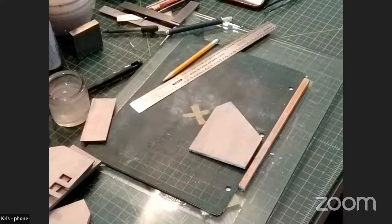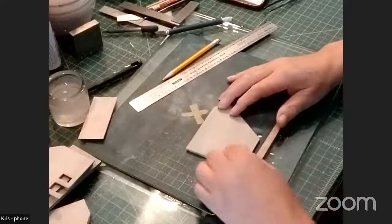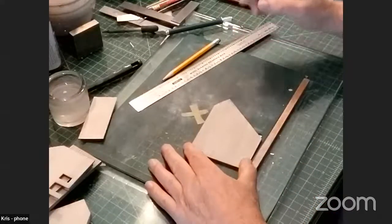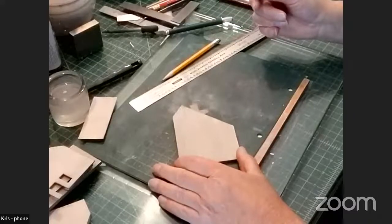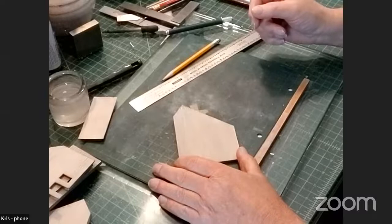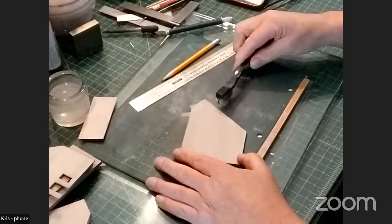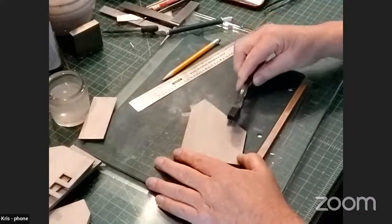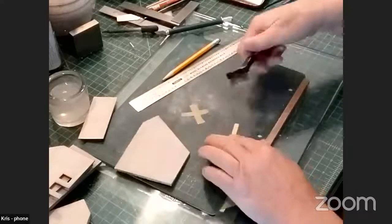If it's a real tall one, then I typically will cut my boards before I apply them to 10 or 12 foot lengths. And then I will go through and add them. And so that naturally gives me the breaks, if you will. Plus I go through and on all of my boards, when I cut them on the edges, I come back with a wire brush and I wire brush the ends of the boards